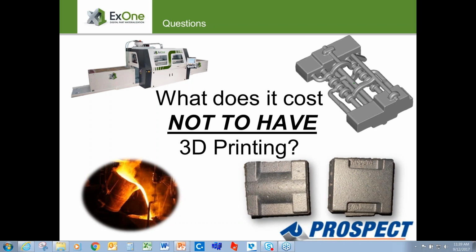And what about the sand testing? Is that done at the foundry or at ExOne? Right. So as far as I can speak, when the cores leave ExOne, Greg and Bob have done some sidebar testing as well. But typically when it leaves our shop, what we do is we print test bars and permeability pucks as well as LOI tokens. So in that 70-inch by 39 by 27-inch build chamber, we fit as many cores as we can to 3D print all at once.